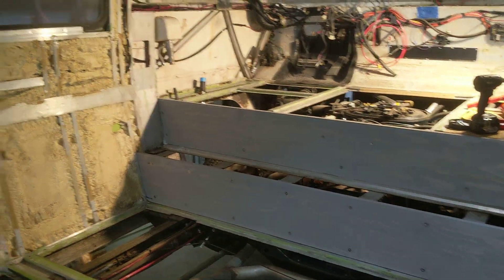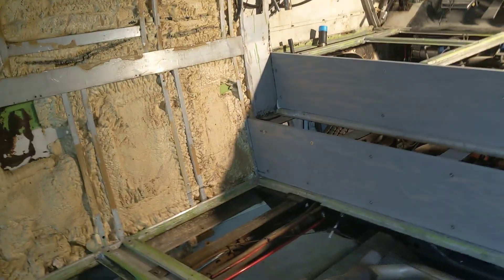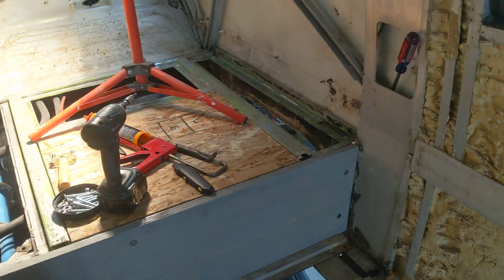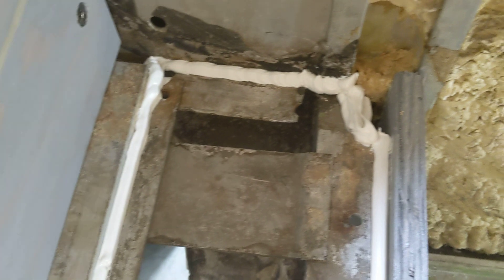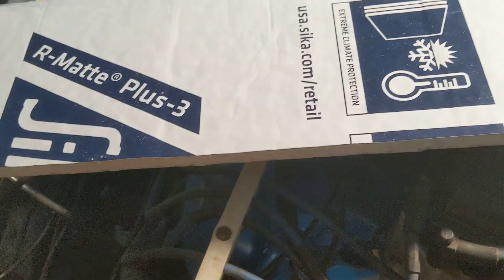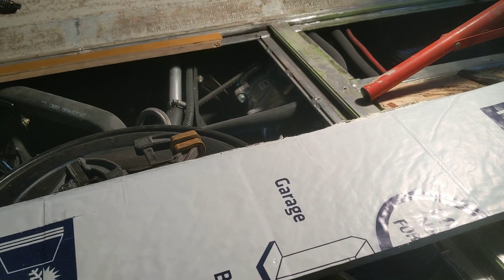I just took a measurement and I'm getting ready to cut some insulation. You can see the upper board is in now, and over there in the corner you can see where it oozed out a little bit where I squeezed it in, but I sealed those areas. You can see how I've put the construction adhesive in a continuous bead, getting ready for the board to go. There is the foil-faced insulation cut — I'll use a little piece of wood to push it in nice and snug. There it is set down in the pocket.